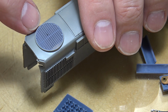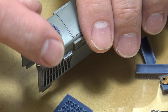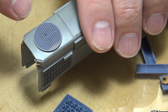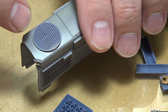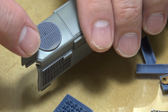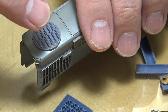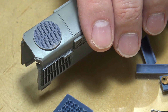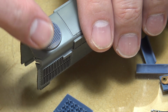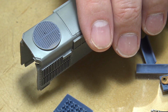So I made this 670 thousandths in diameter, but when I increased the size of the ring to 10 thousandths, I did not take into account that I will be cutting this to 670 thousandths. Well, it worked out perfect, because although I drew it to 670 thousandths, it did not print out to 670 thousandths. It printed out slightly smaller. So it actually fit that perfectly.